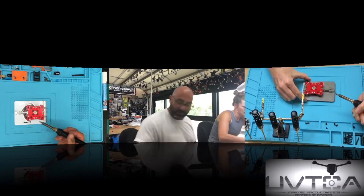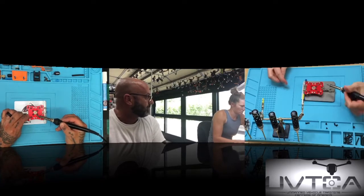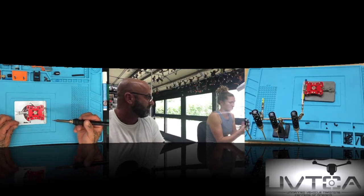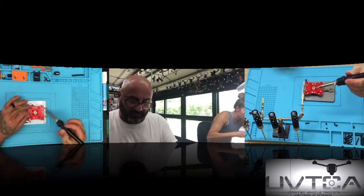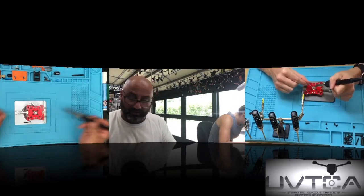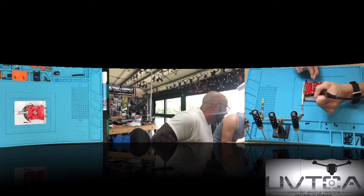Okay, so what I'm trying to tell you is, when you're down there, take the solder and just follow it one lap. You don't have to lift it up and down, because it's still one continuous thing. Good? Okay, now focus on the inner circle. I ran mine. Now hold it down and run it. Go. There you go. Just like that.